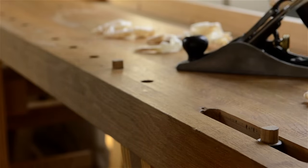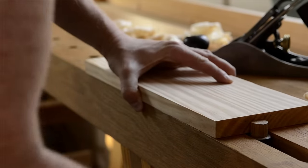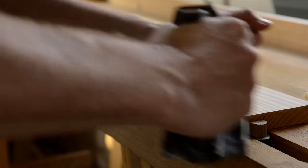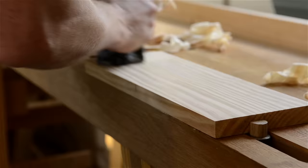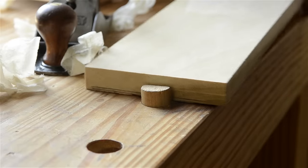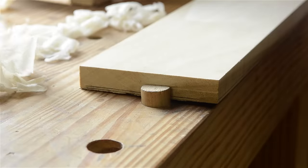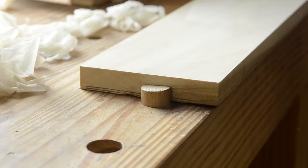As I mentioned in the previous videos on workbenches, bench dogs allow you to wedge your work piece between the tail vise and the bench dogs that sit in your bench dog holes. This is so you can stabilize the wood for hand planing and for making joinery. I prefer to make my own round wooden bench dogs. First, because wooden bench dogs won't hurt your hand plane iron if you accidentally forget to move the bench dog down below the board surface when you're hand planing.